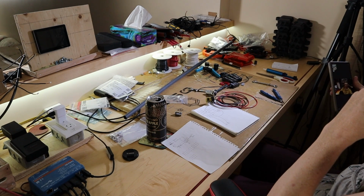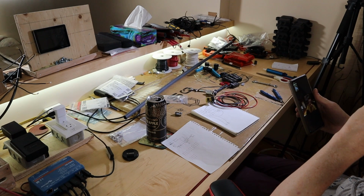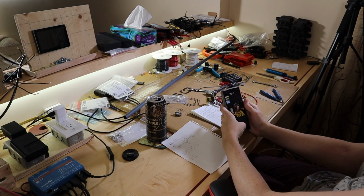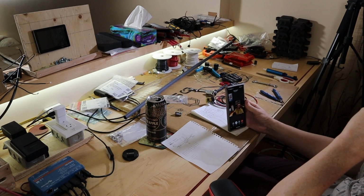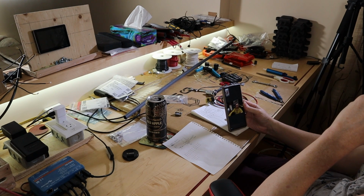This is similar to how if you disconnected the BMSs with the alternator pumping power, you'd burn up your alternator. Same thing. It's got inductance in it, and it's charged up, and there's current flowing, and all of a sudden you open up the circuit, and there's all sorts of energy built up in the magnetism in there. That Victron probably has big inductors in its input to prevent noise from going back into the DC cables. With this kind of snubbing and filtering, when you're dumping a load, things can happen, and you can end up with a reverse polarity spike. And if your circuitry isn't ready to handle that, that's what caused that capacitor to fail, no doubt.